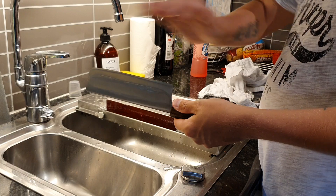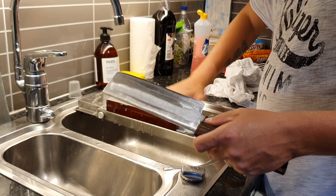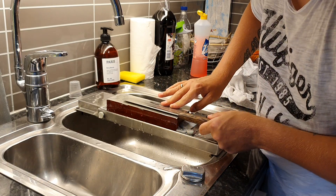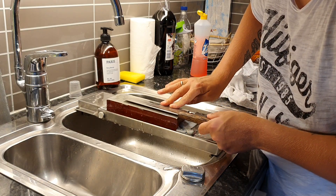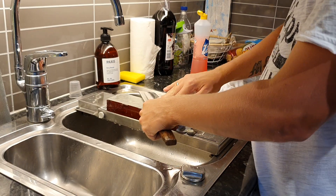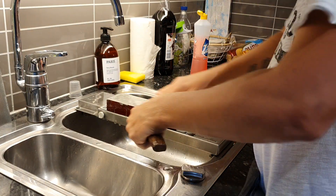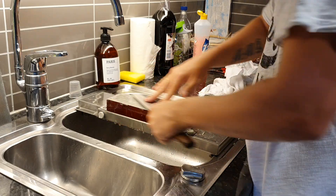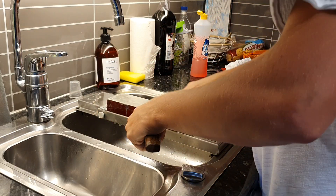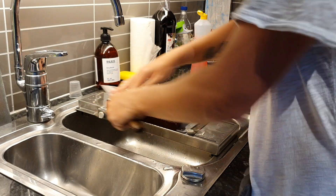I'm gonna drag off the edge — going once, two, and three times — just to make the apex uniformly blunt and remove any weakened metal. So I'm gonna start. This is flat; I'm gonna sharpen maybe two, three, four degrees over that, so very very low. I'm thinking maybe eight or nine — oh sorry, it's way lower than the usual eight or nine degrees.